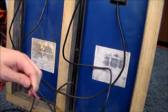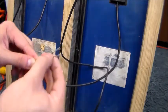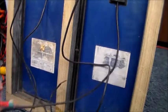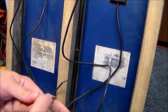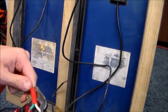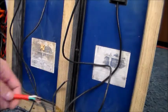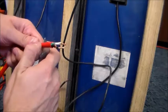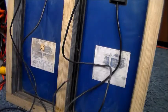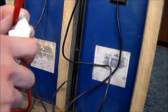I'm stripping them all back at once just to make it easier when soldering — roughly three-quarter of an inch is pretty good. Now here's my regular extension cord. I can't strip it with the wire stripper, so I need to use my knife to cut back some of the insulation. All right, I've got my knife and I'm stripping back some of that orange insulation and cutting back a little more of it.